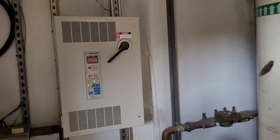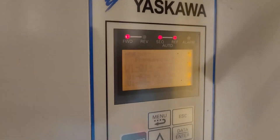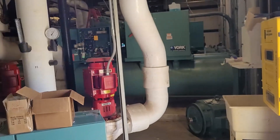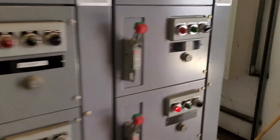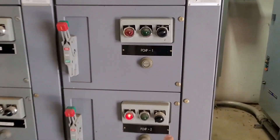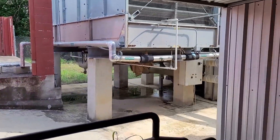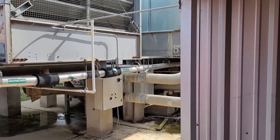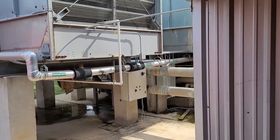To keep pumps running you can go to the VFD, put it in hand, and run it up — it's running at 48 Hz now so I'll just set hand to 48 Hz. The other pumps don't have VFDs, so I look for the hand-off-auto switches; here they are, primary chilled water pumps one and two — just go from auto to hand. The cooling towers have similar HOA switches and also slow and fast speeds; they're running on slow, so I'd just leave them there.